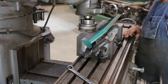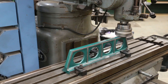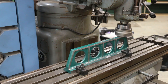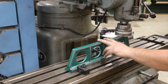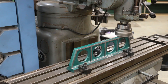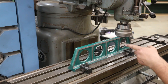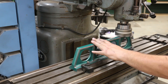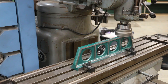We're down to our last operation here — milling the top flat. This is kind of optional, but my theory is if you ever flip it over and have it resting on this side, if it's flat it's not going to tip over on you. I've got a pretty heavy cut going across here, about a 50-thousandth pass. Because you have such short tooth engagement it's a little noisy, but it's making a nice finish. We'll knock the tops off all of these and they should be done.